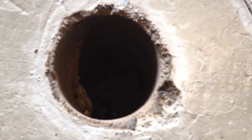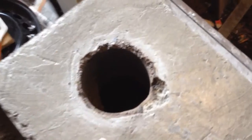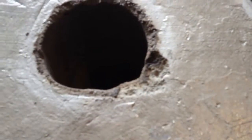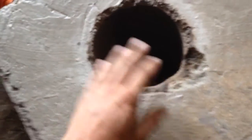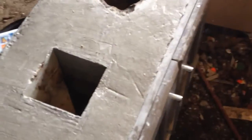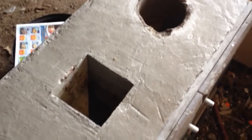When I knocked out the mold, I had a mold pipe in there when I was pouring the core, but when I knocked that mold out, I lost a chunk here. It's not a real big chunk and it's not a real big deal, because I've got to put a riser on here anyway, so I can patch that up. I had this double-wall stainless pipe on there just for experimental purposes, just for burning out the core, and it seemed to work really good.